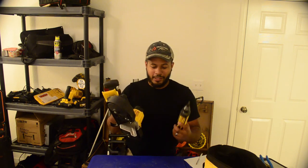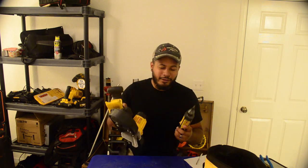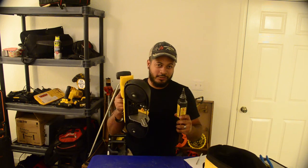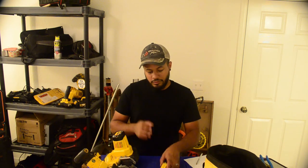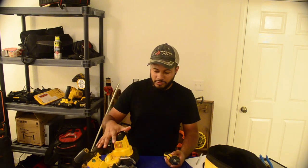This thing just sits in the bottom of my tool bag now. If you already have a cordless bandsaw, you definitely want one of these — they're like best friends. If I'm running conduit, I bust these two out together. Anything from half inch to one inch, it's great. You get a lot of production because you're reaming faster and doing fast cuts. They just work really great together.